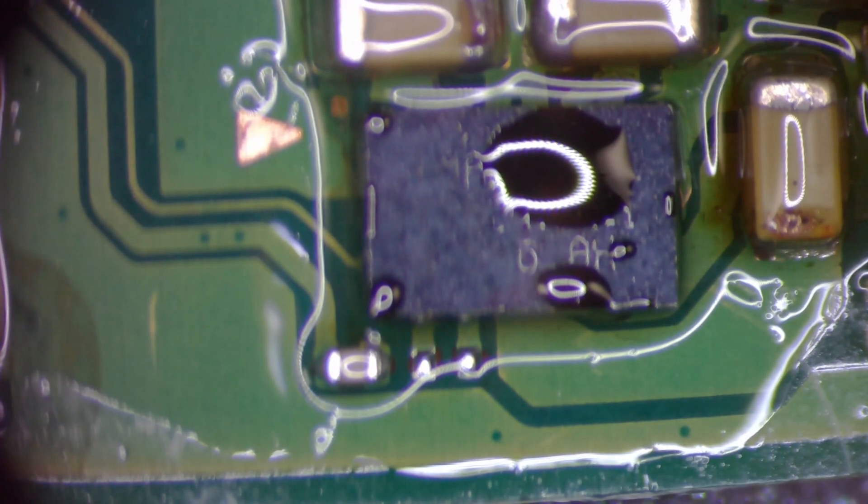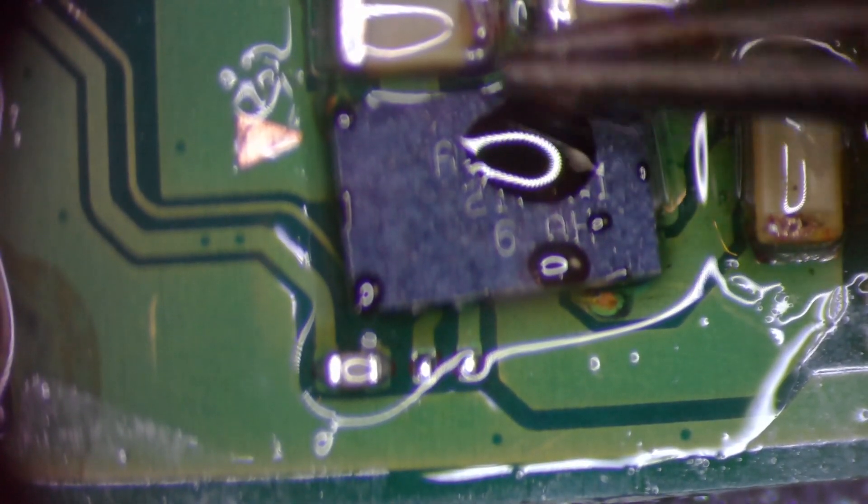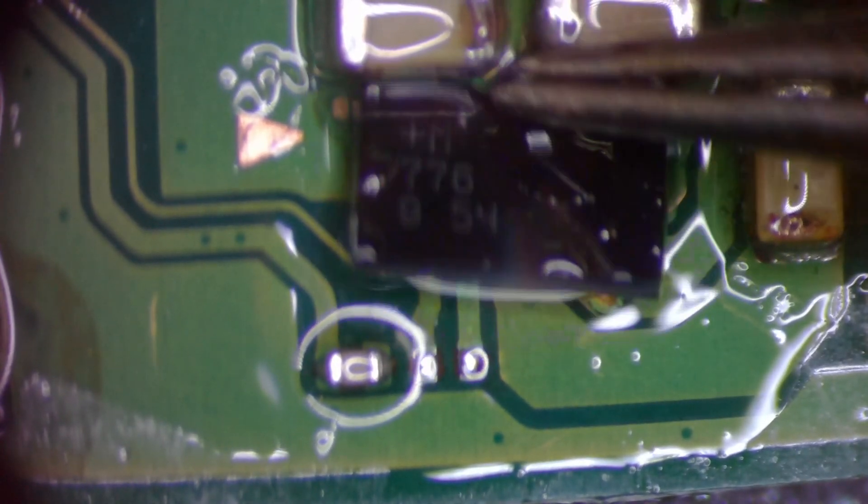All I'm going to do is gently heat the top of the board with my hot air at 25 airflow. I'm just going to gently add some hot air from the top here to see if we can get this thing to flow. That moved on me.